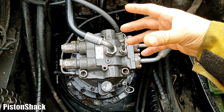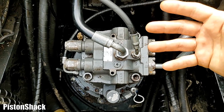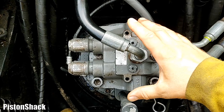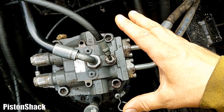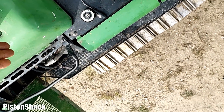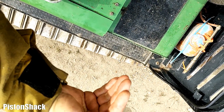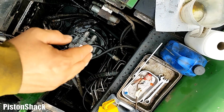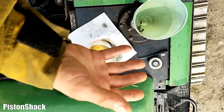When you start dropping the swing motor, the pinion gear might be slightly off the initial position when you pulled it out, and your ring gear might not be in quite the right spot, so the motor will drop but on one side it might stay at a slight angle. To fix this, I used another excavator to push a little bit on one corner of the machine, then a little bit on another — couple inches in and out. That way your house will rotate and the teeth will align. You'll feel it drop in fully — that means you've found the sweet spot. Give it a little turn and then you can start all bolts by hand.